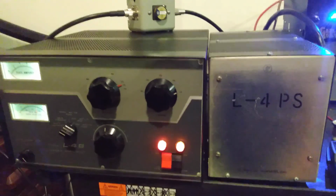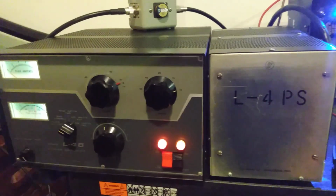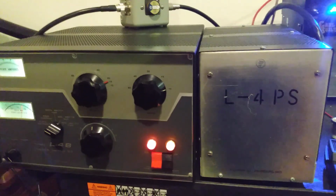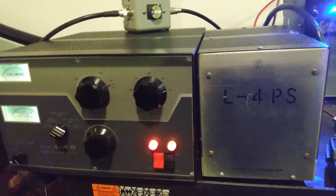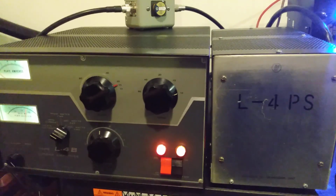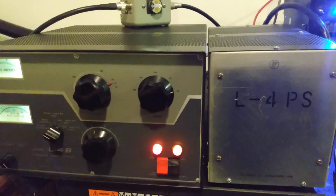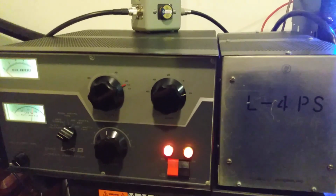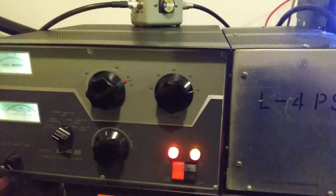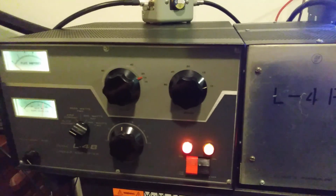I had a three-tuber that I put about 550 watts peak into for 2 or 3 years, never put a tube in it. I had a single tube that I actually did drive too hard, and ended up having to put a tube in it, and I was putting about 200 watts PEP into it. So my recommendation for longevity, lasts forever, 150 watts PEP per tube. And drive them to 500 to 600 watts average per tube, whatever that takes. That's usually about 50 to 60 watts average going in, and 150 to 160 PEP. Now, the breaking point for them, where it starts putting a hurt on them, they heat up real fast, is around 200 watts PEP. So, my opinion, anywhere between 150 and 200, you're kind of in the safe zone. I like to run mine a little bit on the conservative side, around 150 watts PEP per tube.